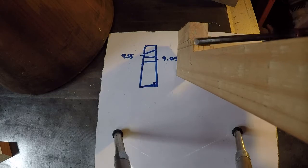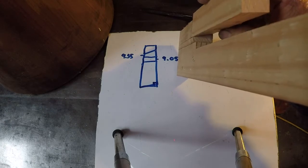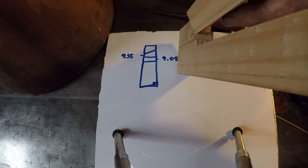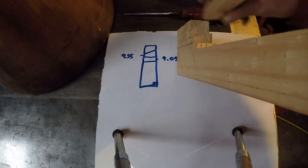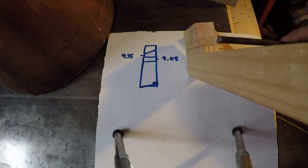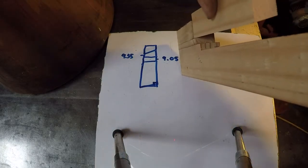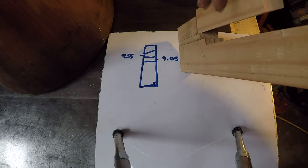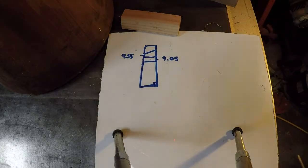You've got to measure it, because when you're on your second cut, the piece that you're cutting is going to be sitting up on there, down like that. So it's this long measurement, the outside measurement, that you want. That's why we're using this part here. You don't worry about this, just make that 15 degrees. I then use the opposite offcut of that piece and stick that on the top. Just bear in mind with these, the high part must always go on the right hand side. That's because when you do that cut, it'll put this part here at the bottom that goes on the table. It doesn't matter how thin your jig is, that long point's always going to be in the same position.